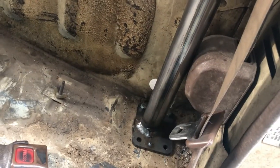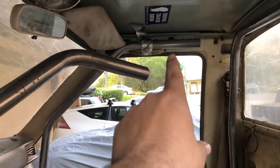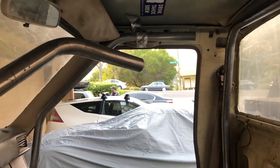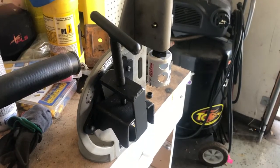I bolted the two rear holes on both sides, and then on the upper pipe here I cut four more inches off from the end right here to get the piece more center. In order to notch all this pipe I'm using this Harbor Freight notcher right here.